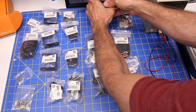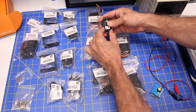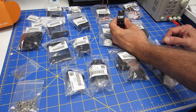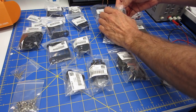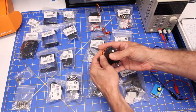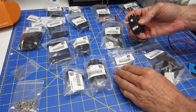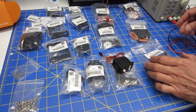Then you've got these two big beasts — the DSS-M15 motors made for DF-Robot. These are metal gear motors rated at 15 kilograms per centimeter, so these are very strong motors. I'm going to be using these for the elbow and the shoulder, or base. There's also a fifth DF-Robot motor rated at about 5 kilograms per centimeter, which will be used up around the wrist joint. It's a plastic-geared servo, and all servos come with the different appendages, horns, and things that attach to them.